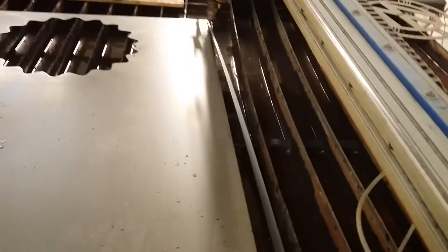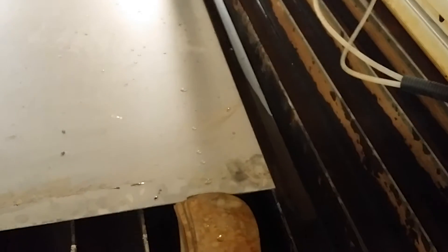That's at 150 inches per minute, little to no dross, and you can see in four feet from the beginning across here, you can see that torch just jumping up and down, maintaining that height. Got a beautiful cut all the way across. I am so happy with this upgrade.